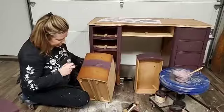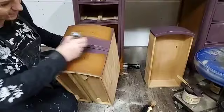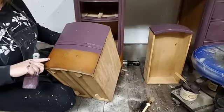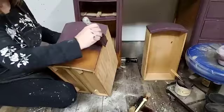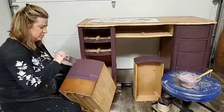I'm making sure I get into this double drawer — it's one piece but a double drawer — getting in underneath the crevice. Pulling the drawers out lets you make sure you don't miss any spots. I'll brush the paint on vertically first and then come back horizontally. Since the grain of my wood runs horizontally, I run my final brush strokes in the same direction as the wood grain.